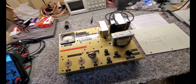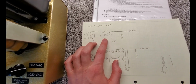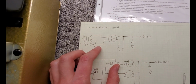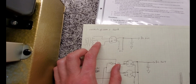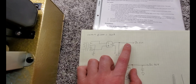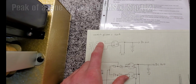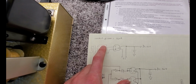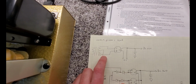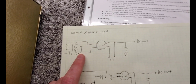So a little bit of quick background info, and I don't want to belabor this too much, but tube rectifiers are commonly used in a full wave rectifier arrangement where you've got a transformer that has a winding with a center tap. Typically, to get, say, 400 volts RMS, so 400 volts times square root of 2 peak, held on this capacitor for a DC voltage, you need a transformer that's 400 volts from one side to the center tap, and then another 400 volts from the center tap to the lower winding. So typically called a 400-0-400 secondary power transformer. That's typically how those are rated.